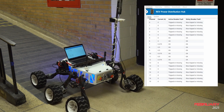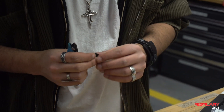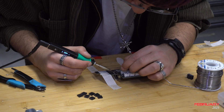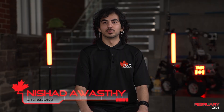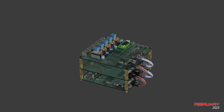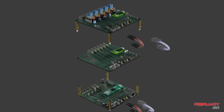The current monitoring system will work in conjunction with the auto-resetting breakers integrated into our power distribution board. This year, we've also moved to a fully modular control system comprising a main compute board and various peripheral boards. Each peripheral board allows us to add functionality without having to redesign our entire control system. The rover itself, arm, and science console all have their own modular board stack.